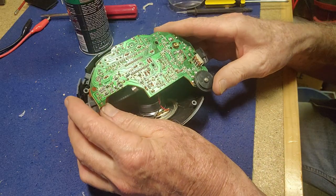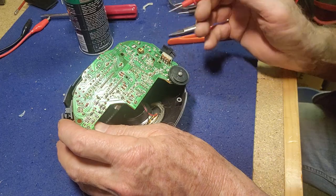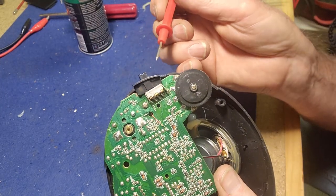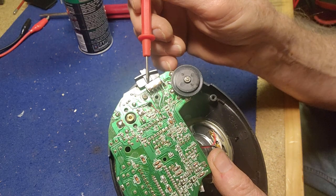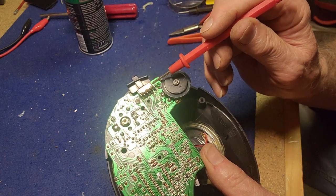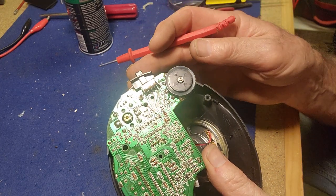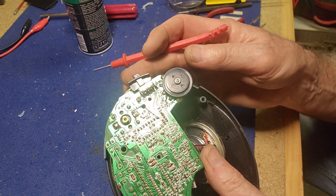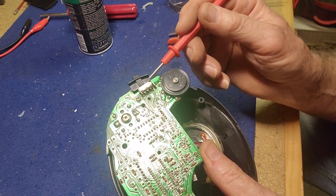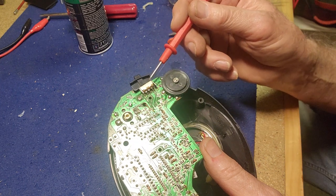I've been fiddling around for a little while. I have re-soldered that fine wire - the antenna wire - but something I noticed in this area is the switch. I think it's the AM-FM switch and it's all kinked sideways. The terminals are on a bit of an angle - the square boxing of the actual switch case is skewed to one side. So I expect the thing may have been dropped, possibly when the alarm went off one morning and someone wasn't happy with it and gave it a thump, or it flew across the room. The switch may have kicked sideways and we might not have proper connections. I've just re-soldered the connections to the board - they looked okay - but there may be an issue within the switch.